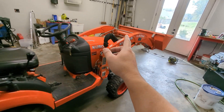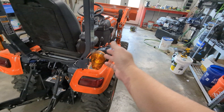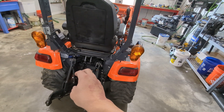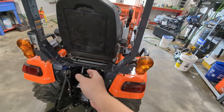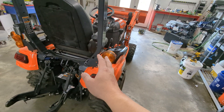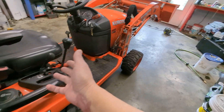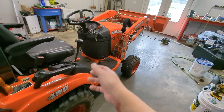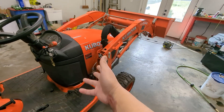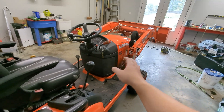This came sooner than I expected because I really thought I was going to need to address the hydraulic pump before I could do anything with cylinders. The hydraulic pump on this tractor is a little more integrated than on the one series. It also has the priority flow divider basically integrated into it. I knew that was going to take a lot longer to solve for. I am working on that, but I'm also not necessarily convinced it's really necessary.